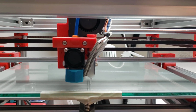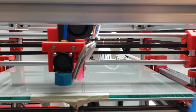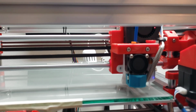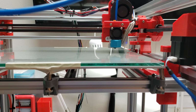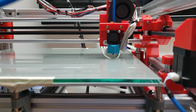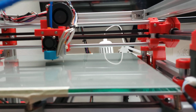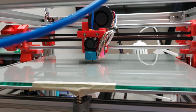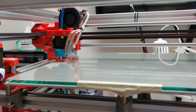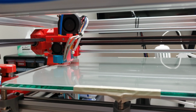And what it's going to do is it's going to store a mesh of what those probe height distances are, so that when it goes to actually print, it can reference that mesh and it can compensate if there's any sort of warping in the bed or any sort of out of level or out of tram, actually. And it'll compensate for that because the layer thickness is very important, which is why I was saying not having the right stepper motors and having some backlash in there is irritating me. But anyways, like I said, it'll probe this in 9 different spots.